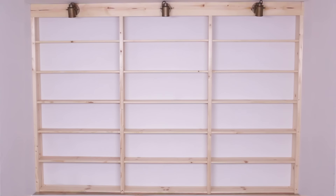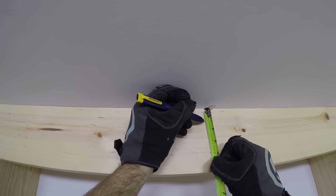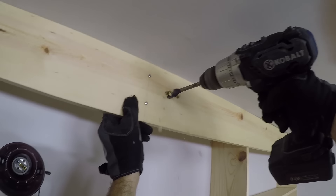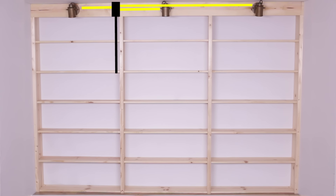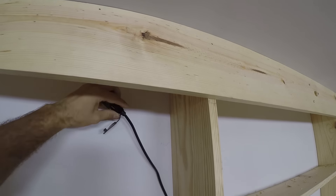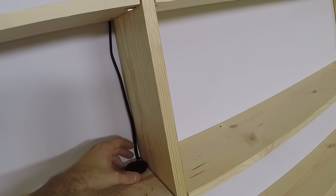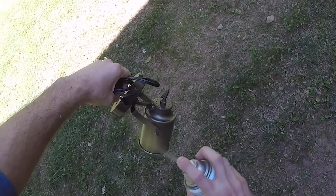Almost ready to put paint on this thing and call it a day. But first, do you remember that surprise project I mentioned? What's a bookshelf without some good accent lighting, right? I'm using these inexpensive plug-in lights, so it's really not that complicated. Start by making a 6-inch header board and installing it across the top of the shelves. Find the center of each shelf and mark it on the header, then install the hanging hardware. Drill out a 1-inch hole behind each light for the cord to run through, and then drill out another 1-inch hole in each of the columns for the cords to run through and unify on an extension cord. I made a dog-ear cut on each of the shelves where I'd have my extension cord running up, so it'll hide behind there — it all depends on where your outlet is. I also got to sneak in a really cool feature: a little touch-activated on and off switch. Once I got all the wiring worked out, I finished by spray painting each light with antique brass spray paint.